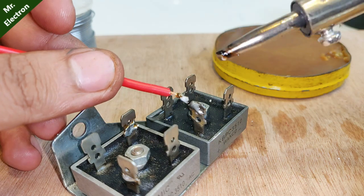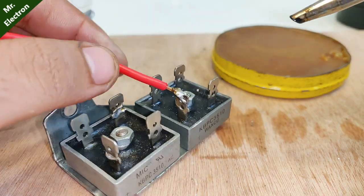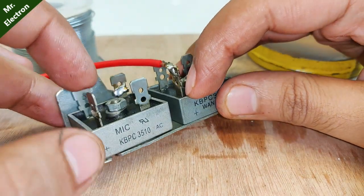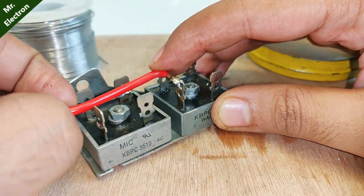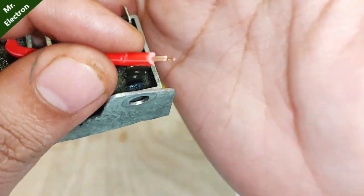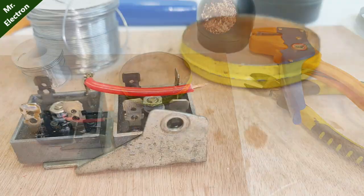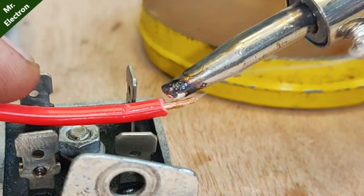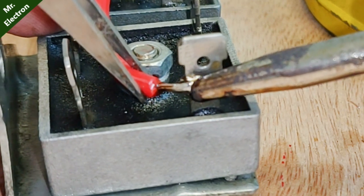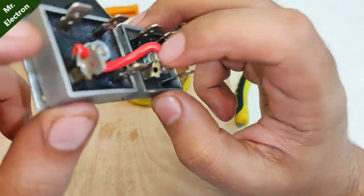See how beautifully the soldering is working now — all because of removing the oxidation layer. After soldering the positive wire, measure the length from here to here because we're going to connect the positive terminal of this rectifier to the positive terminal of the other one. Note: if you use a thicker wire it can cut a few strands sometimes.